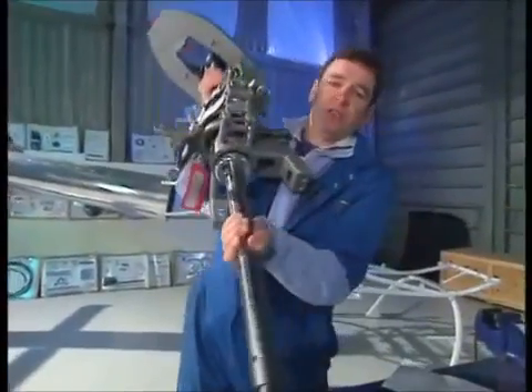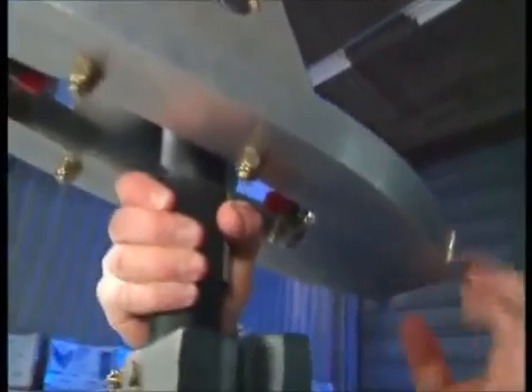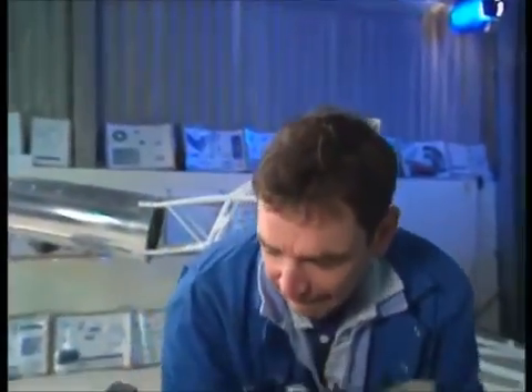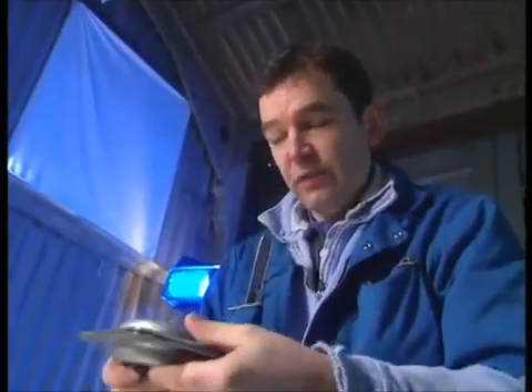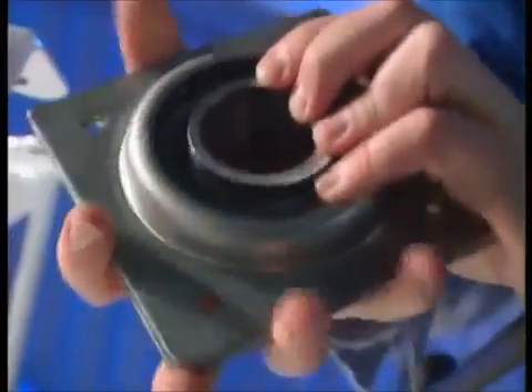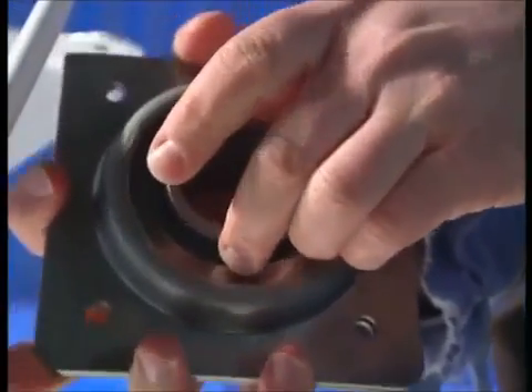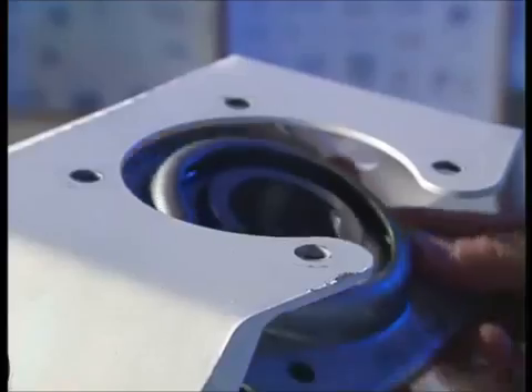This is very large and very expensive — it costs about three thousand pounds. If I hold it up this way you'll see it's actually the bit you attach the blades to: it's the main rotor shaft. But before you can put this in the helicopter you need to fit one of these — yes, you need your DIY ladders when you're doing this job, because you need to be at the top of the airframe. This is where this bearing is going to sit. It's a heavy bit of kit, so take your jacket and drop it down there as a little bit of protection. The bearing itself is housed within a plate — it's a movable, self-adjusting bearing. If you look on the underside you can see the hole is eccentric to the outside, because there will be a locking ring that eventually will lock onto the shaft at the front top.